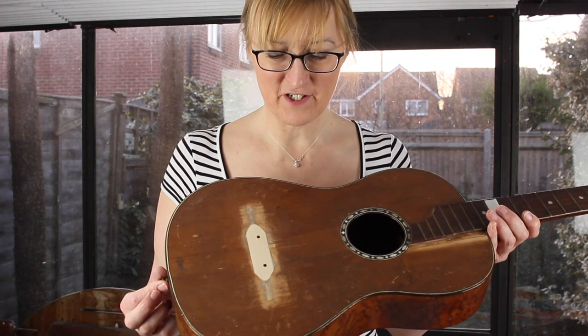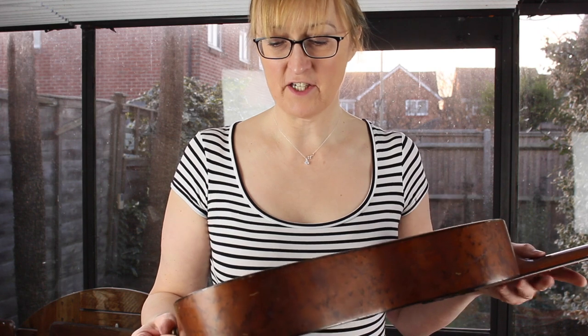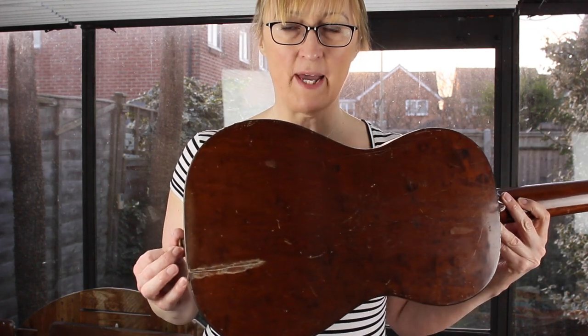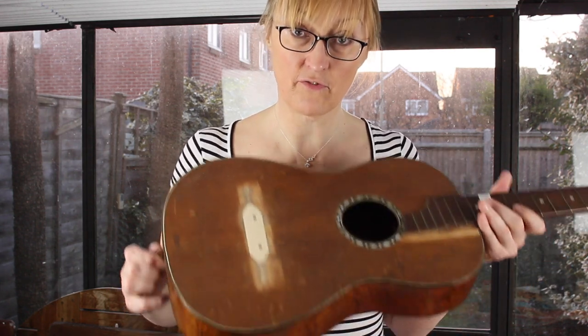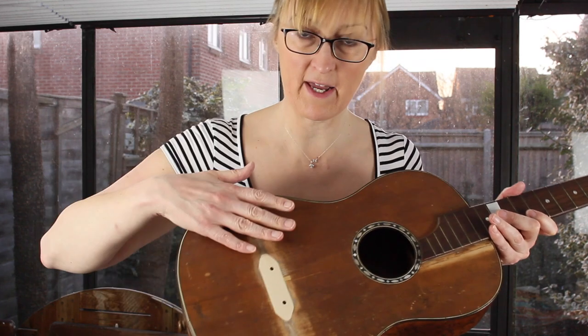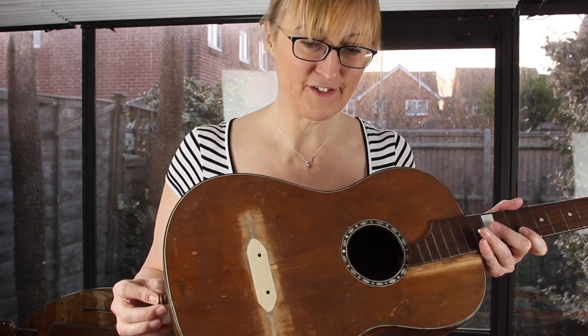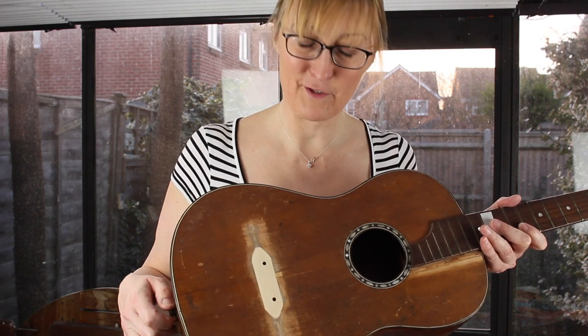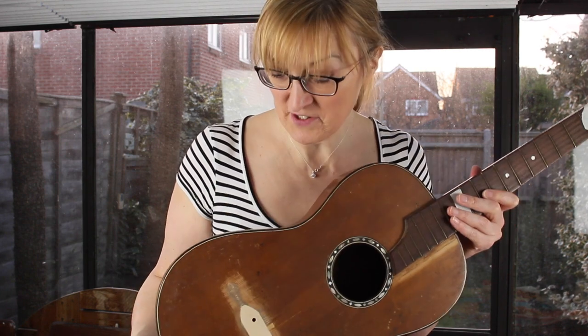I'm now at the stage where I have got to do the finish. I suspect I'm going to leave the back as it is and just patch it and buff it and apply a little bit of shellac here and there, but I think the front is going to get all stripped back and shellac French polished. But I will be taking advice on this, as you'll see in the next video in this series.